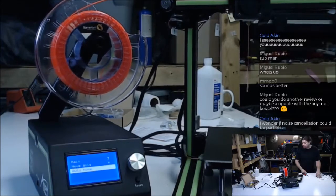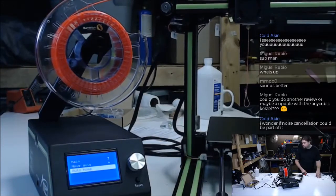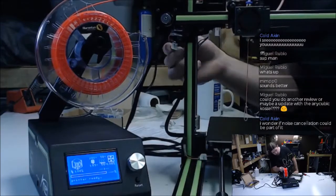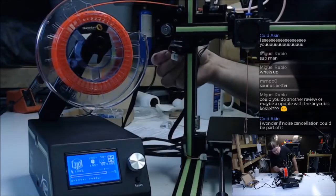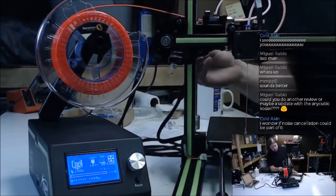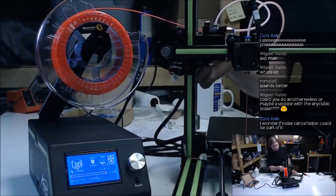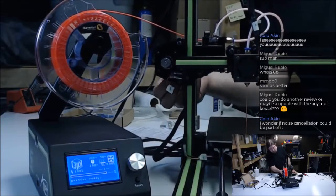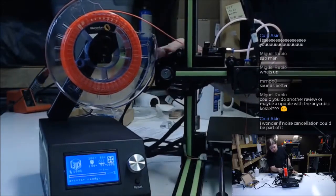So the extruder wire. So it looks like they have the label on the X axis motor and the extruder label flopped. So when it tried to home, it just extruded a bunch of plastic because it was trying to move the X carriage. So those are labeled incorrectly. So we will switch those around and give it another try.